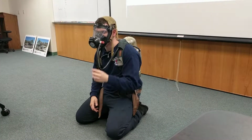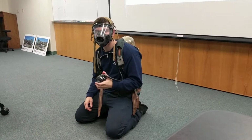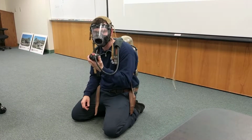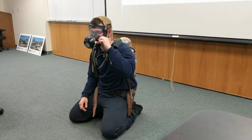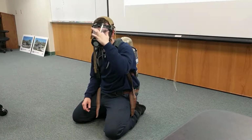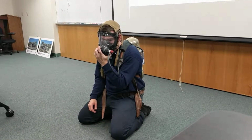It's at first breath activation, so a lot of people will freak out when they put it on and they don't have any air coming out, so make sure to breathe when you put it on. And then when you put it on, you're gonna open it up and say purge valve. And when you have a heads-up display, you're gonna say heads-up display. And then to take it off, it's a quarter turn.